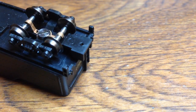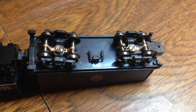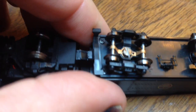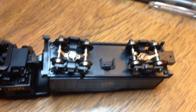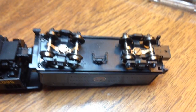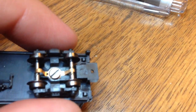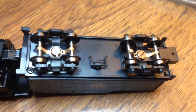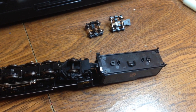It's still a good running little guy and really worth fixing. It's also missing its coupler. I'm going to remove these two screws and also the little screws at the front of the tender, but I'll start by removing the trucks. One side picks up one side of the track and the other truck picks up the other side, so keep in mind which side is picking up what. I'll put the two trucks in the order I took them out, right next to the tender.